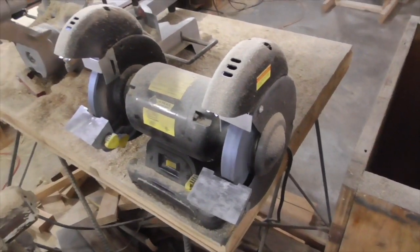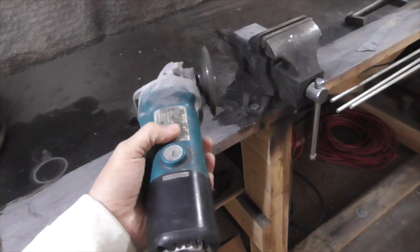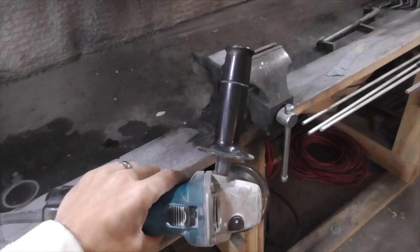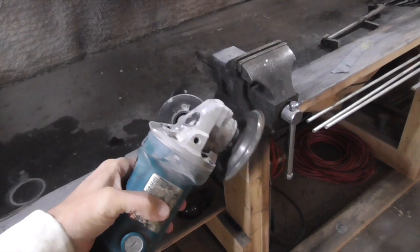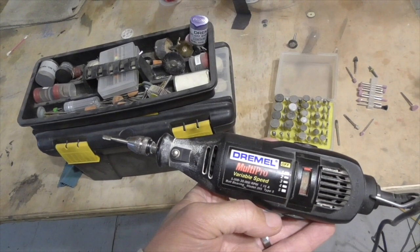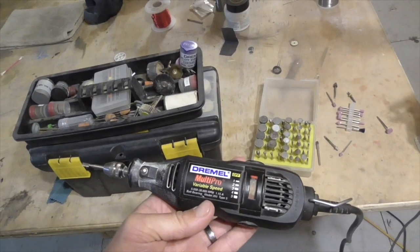Once you've got a drill press, pretty soon you'll find you need a bench grinder for sharpening drill bits. Another tool to consider in the same vein as the hacksaw and hand files is an angle grinder. With a typical grinding disk it removes metal a lot faster than a hand file, but generally with less precision. If you end up getting a milling machine, that will allow you to remove metal faster than the grinder and more precisely than the file, but even then, the angle grinder still comes in handy for deburring and smoothing corners on metal parts, typically using a flap wheel rather than a grinding disk. A Dremel or similar rotary tool also comes in really handy for hand carving any small feature or detail into a metal part that you can't quite cut with your other tools. It's also good for smoothing and polishing certain parts or surfaces.